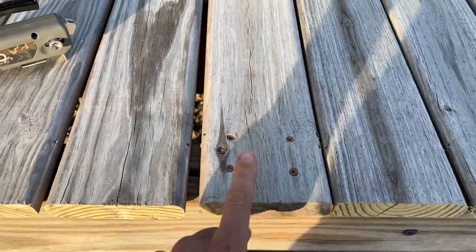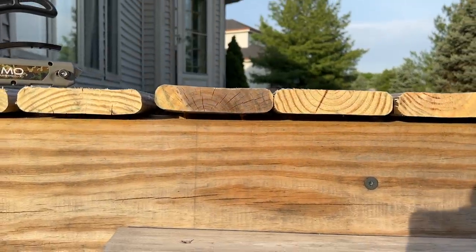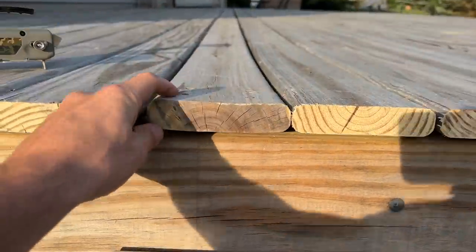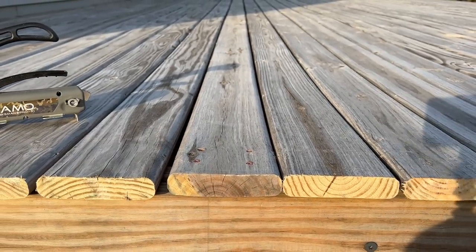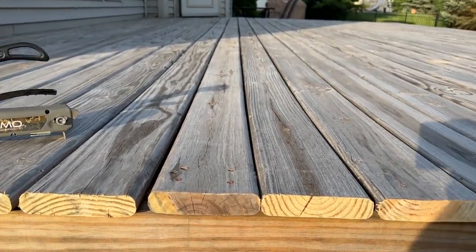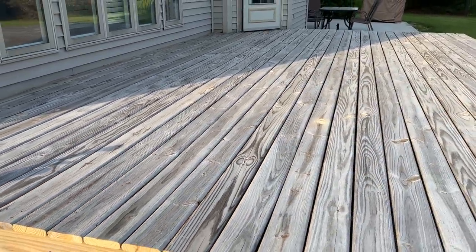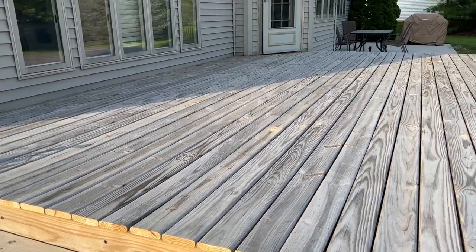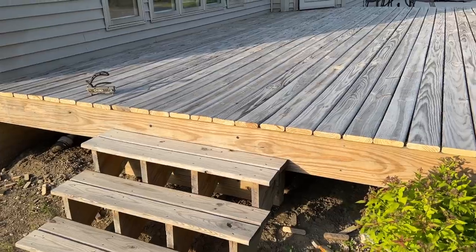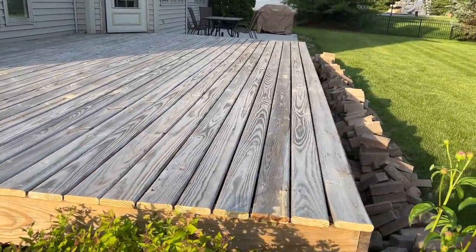The CAMO system has held the boards down except for this one board, which has really curled up a bit over the years. I had to drill, countersink, and set four deck screws to try to hold it down. Other than that, everything's behaved fairly well. One of the embarrassing things — which you might have already noticed — is that in two years I have still not sealed the deck. So that will be done, and I'll at least post a picture on the community tab proving I finally sealed it.